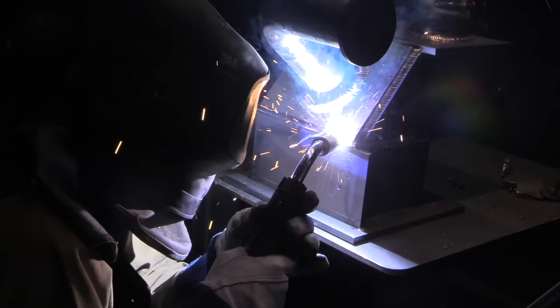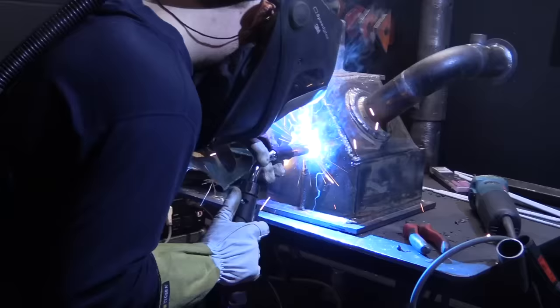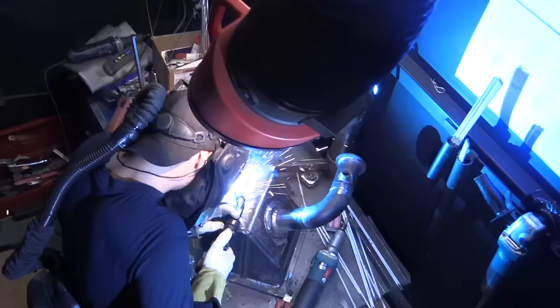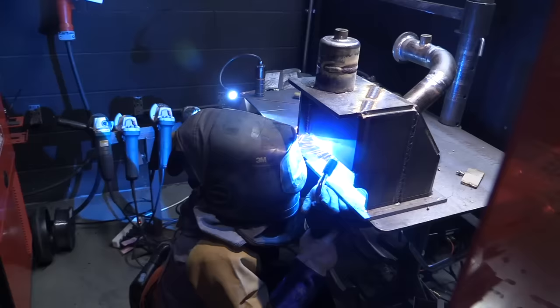They practice similar pressure vessels before they come to this competition, but they don't know exactly what the pressure vessel is going to be — there can be last-minute changes just to keep everybody on their toes. There's a wide variety of joints: butt joints, outside corner joints, pipe joints, TIG, MIG, stick, dual shield flux core — all done with a time limit, all visually inspected and graded to really tight criteria, and all tested to a thousand PSI.